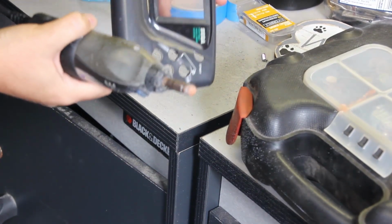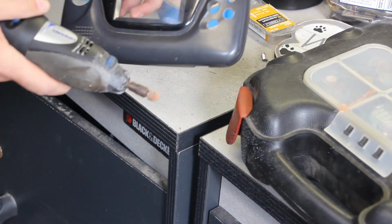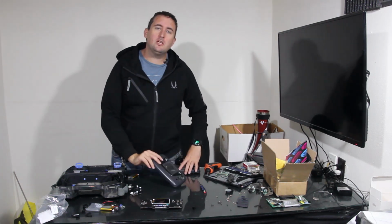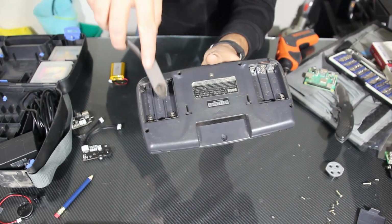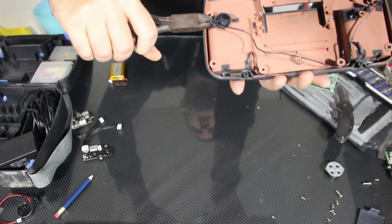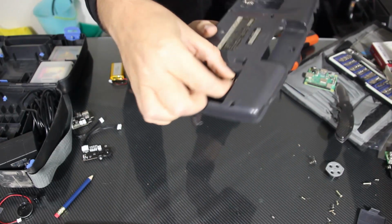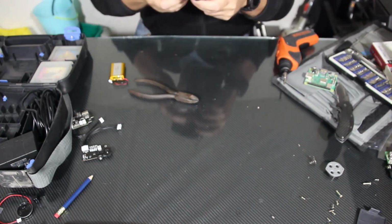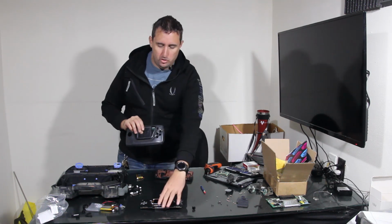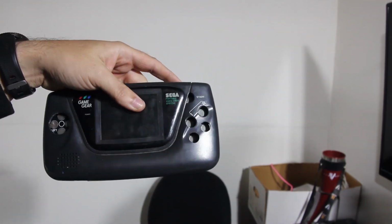Now that we've got the 4 holes in, we need to make sure that the outsides here are nice and clean. So I'm going to do that with the Dremel and open them up ever so slightly as well to make sure that the buttons fit in there cleanly without snagging on anything. Well, with the holes drilled, we can finally continue our assembly. Right after we remove the top springs from the back side, we're going to leave the bottom spring attached to the rear of the unit so that they better hold our new batteries in without them jostling around while we are using this on the go. So we're going to do that now and take out the top springs on both of the AA battery compartments. But as you can see, our sketch and then drill idea worked great. If we line this up with the PCB, quite happy how that came out.